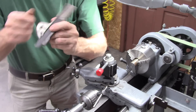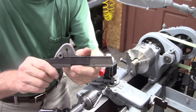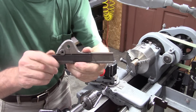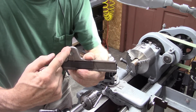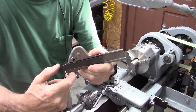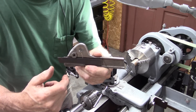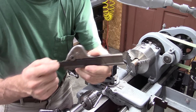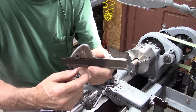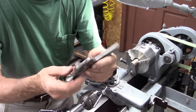This is the original Armstrong spring cutoff — or actually this one's Williams. I think they both made them. What happens is it flexes right here and the blade pulls back out of the work. So instead of grabbing the work and tipping into it, it pulls back out of the work, and it works great.